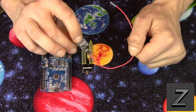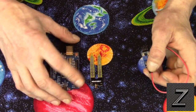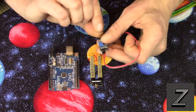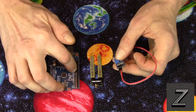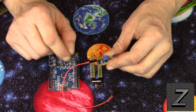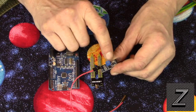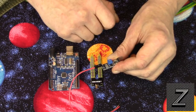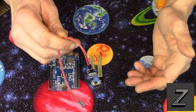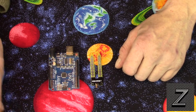Actually, the readings come out backwards compared to if you just hook this up directly to an analog pin and read it. My recommendation is: unless you want a digital high or digital low signal — in which case you'd connect it to one of your digital pins and set your sensitivity with the potentiometer — skip it. When the soil reading gets dry enough, it'll turn on a little LED on the board and power that pin, which you could use to drive a transistor. But otherwise for Arduino, you don't need this. Just set it aside and forget about it.